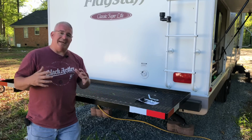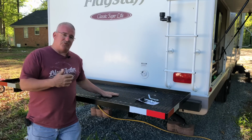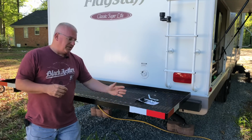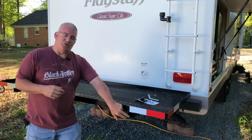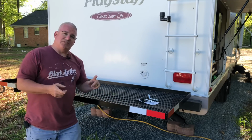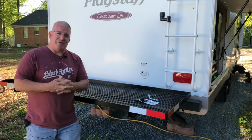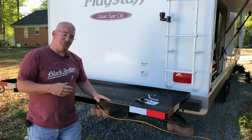Now I've also bought a deck box which I'm going to mount to it, but for the meantime I'm going to show you how I made the rack. It's expanded metal, angle iron, and 2-inch square tubing. The 2-inch square tubing goes into the receivers. Now I'm using 2 receivers, both rated at 500 pounds each, so I'm guessing this thing's rated at 1,000.